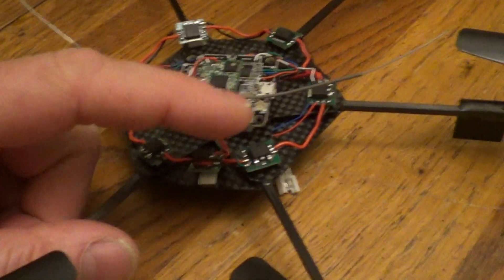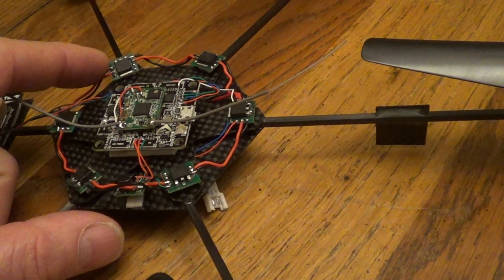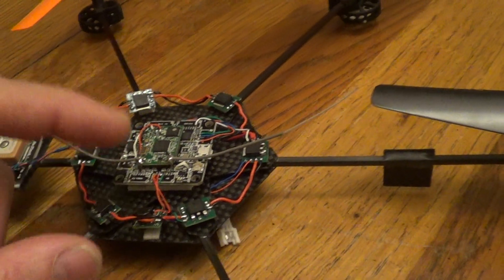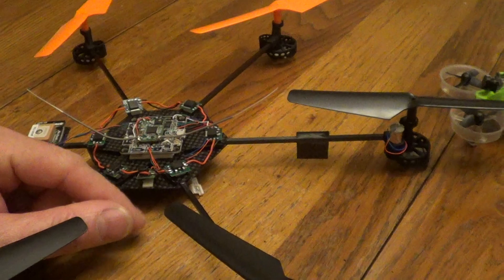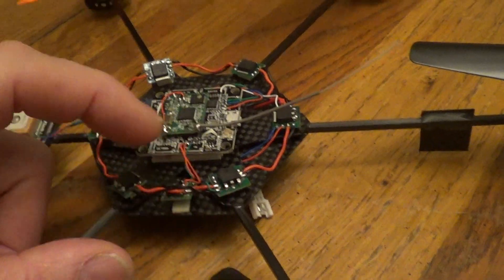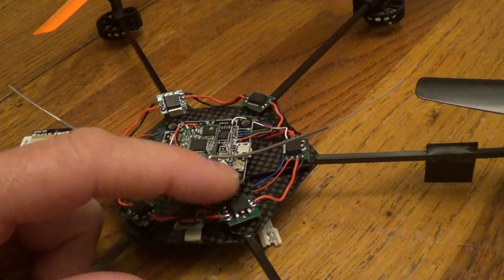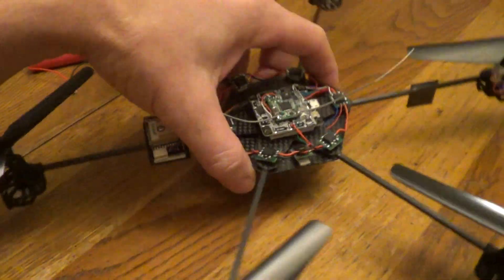I had to get some speed controllers from Australia from Micron Wings, but they don't work with the frame rate. I can't even get these motors to run — he confirmed these are just for slow frame, which is 50 times a second. But the Eagle Tree Vector puts out 400 frames per second on the PWM and that controller just gets confused and barely runs the motor.